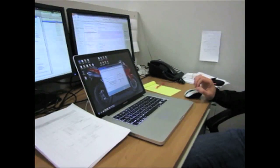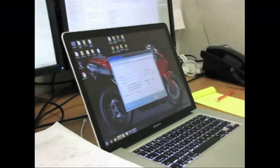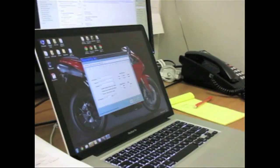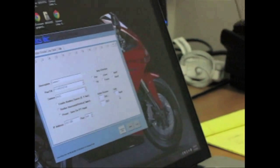We could also tally the camera. On the front of our compact, we have a red light for tally — and that's also the tally input. On the back of the RCP, we have a USB contact closure interface that would allow us to tally the cameras.